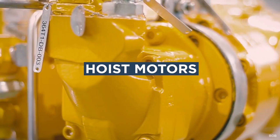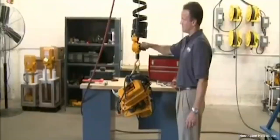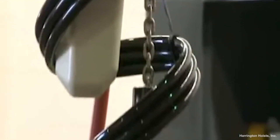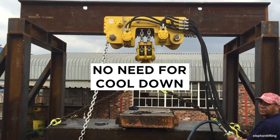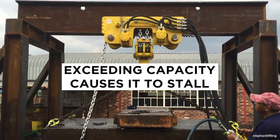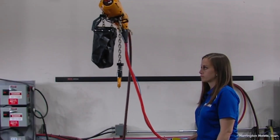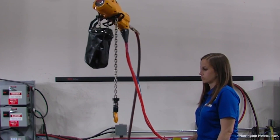There are four ways to power a hoist: air, electricity, gas or diesel, or hydraulics. Air, also known as pneumatic, uses air pressure to power the hoist. Although pneumatic motors generate less power than electric motors, advantages include: no electricity access needed, no need to cool the motor between cycles, no spark created (making it safer), and exceeding motor capacity causes a stall rather than damage. Air hoists have simple controls—ropes extend to valves on the motor to operate forward and reverse, and a mechanical brake holds the hoisted load.